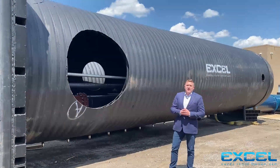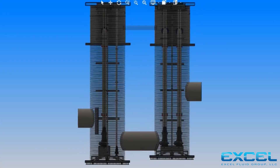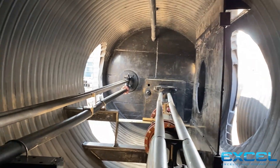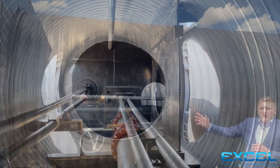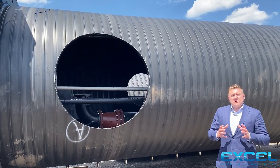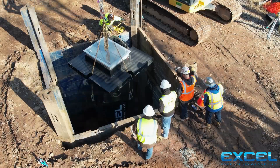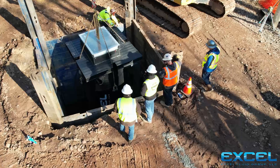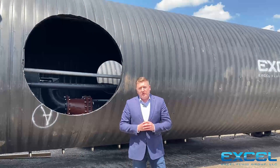This project has a twin pump system with a 10 inch discharge with 16 inch discharge piping, and you can see all the mechanical components are pre-installed here at our facility. We fabricate the raw barrel into a turnkey wet well and outfit it with the mechanical components, saving the contractor time and reducing risk during installation — eliminating the need to send construction crews into a structure to fully kit out the mechanical components.